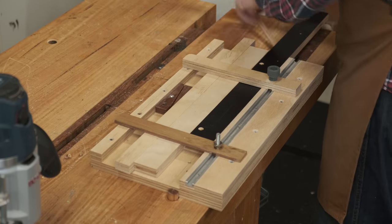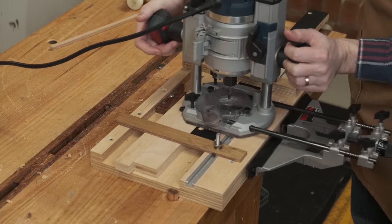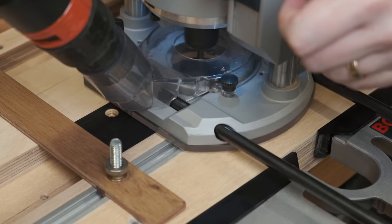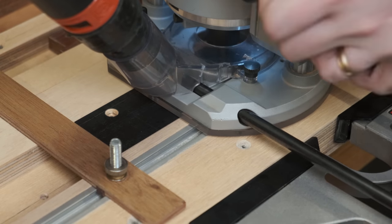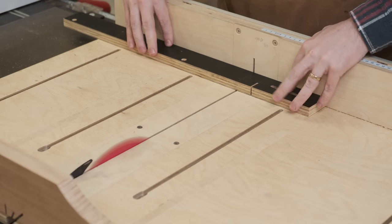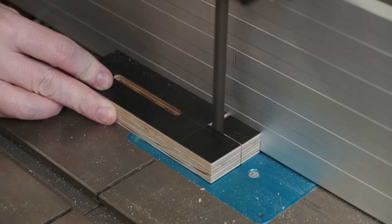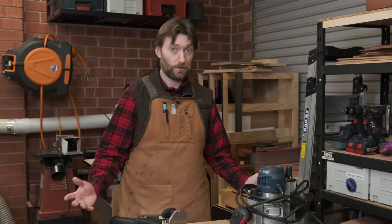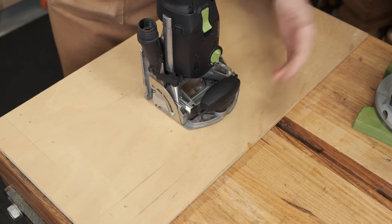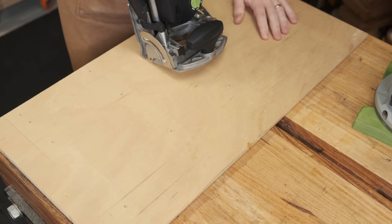It's great to have a flexible table, but it's rare you'd ever make just a single mortise. It's usually multiple pieces with mortises in the same spot, so to take the guesswork out of it I need some stops. Using my small parts routing jig version 2, I can easily and safely rout a through groove for a bolt. To make the stop even more useful, it will have an L-shape. To make that nice and square, a partial cut is made at the table saw, then it's cut to length, and the final L-shape is cut at the bandsaw. If you've ever used a biscuit jointer or a Domino on plywood, you'll know that getting it in the middle of the board can be tricky — how do you keep everything square? You usually have to clamp across it, and if you've got a few to do, it can be a real pain.